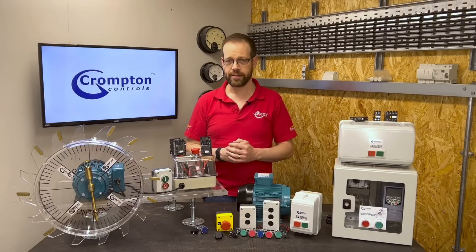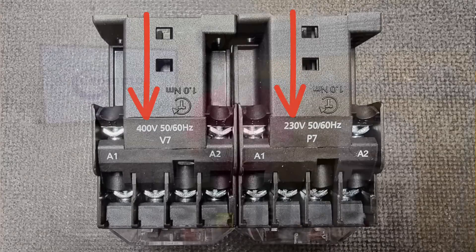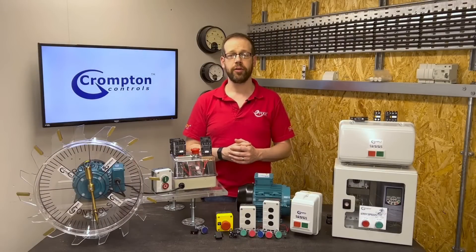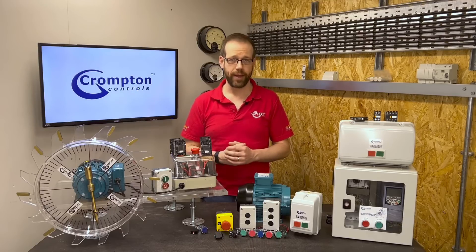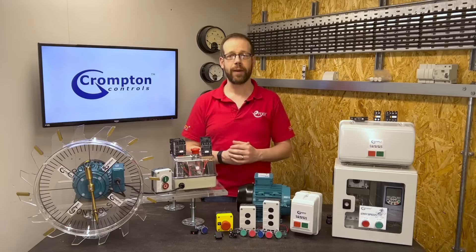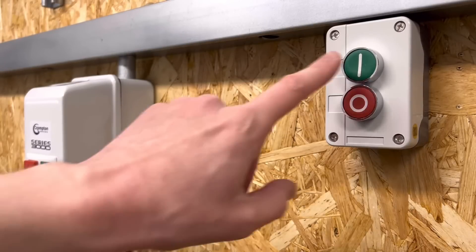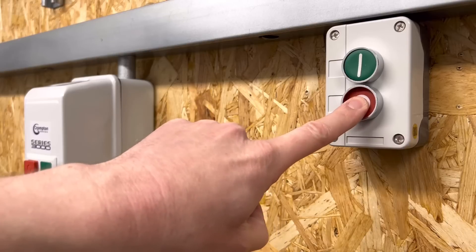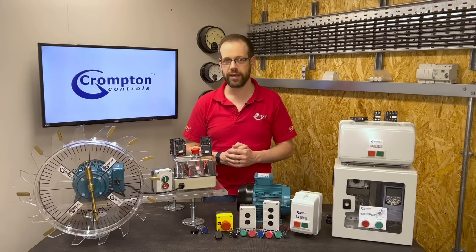One thing to look out for on contactors is that they come in a variety of operating voltages. They may require 400 volts, in which case you would connect them across two phases of a three-phase supply, or they may need 230 volts, connecting across a line and neutral — which is useful for single-phase motors. Other variants include 110 volts, 48 volts, 24 volts and 12 volts, with those three lower voltages also sometimes coming in DC format. These would require transformers and DC power supplies for the control circuits, and have the advantage of using safer voltage levels for the controls — the part humans come into contact with the most. Lower voltages also mean the insulation requirements for equipment become a bit less stringent.